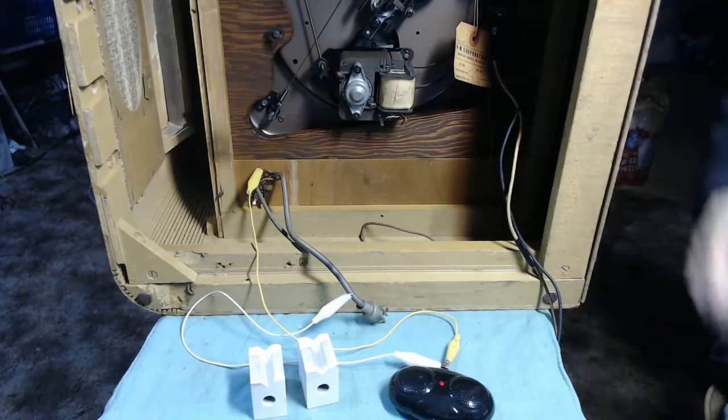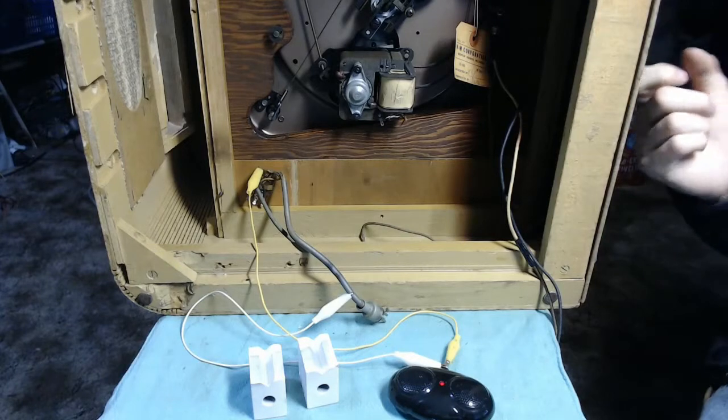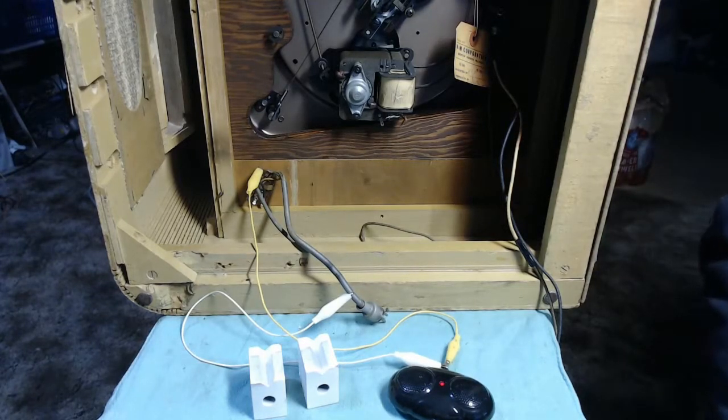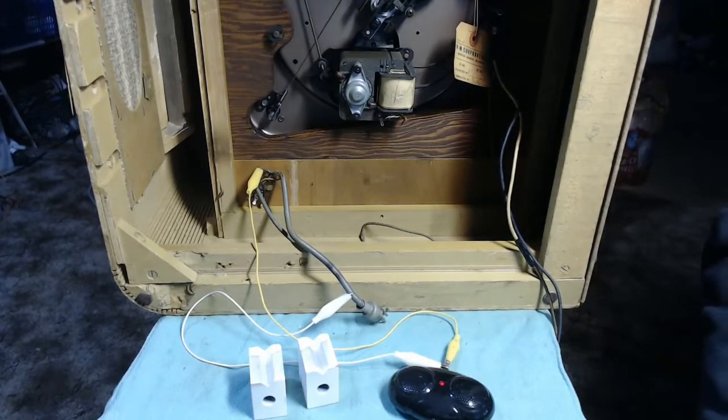And plus, any of those stereo 3.5 mil jacks you're going to get have such a very thin amount of threading on them that you can only really put them through very thin materials, very thin plastic, very thin sheet metal. So a piece of, I don't know, 3/8 masonite, you're not going to get through that. Not enough to put a nut on the other end. So this works. Next stage, I'm going to have to get some hardware.